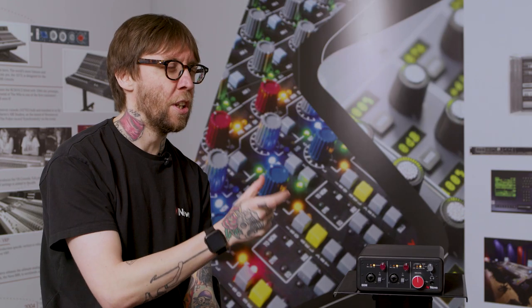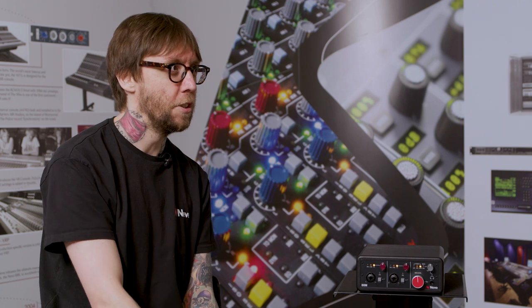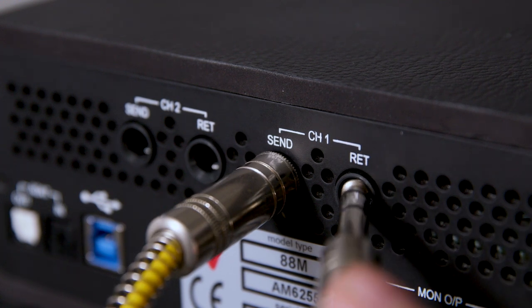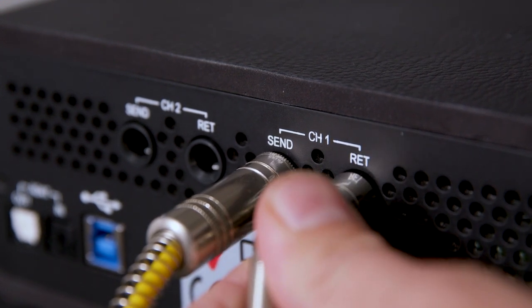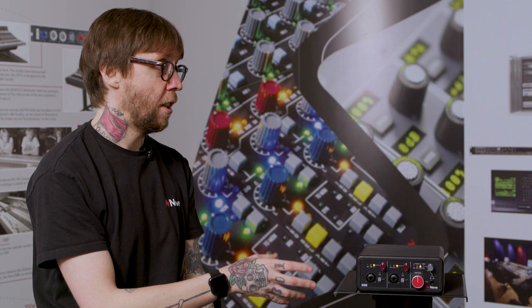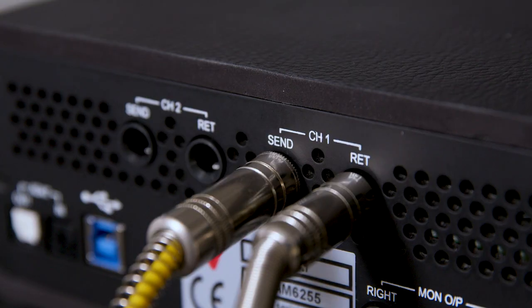Just giving you a little bit of warning then before you start hitting the analog to digital converters. And you've gone for balanced inserts as well. Yeah, so each of these preamp channels has a balanced insert circuit, which has a send and a return path. So this is great for combining professional analog gear balanced at 4 dBU. That's a really cool feature because you can just link up any outboard gear. Then I can use my 2254 compressor, for example.